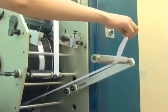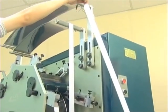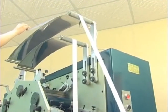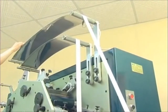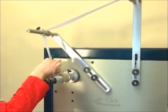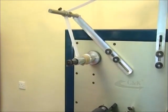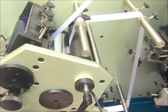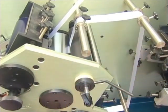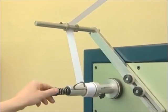When the ribbon is transferred out of the central drum, pull the ribbon to the top heat plate. Place a ribbon core on the rewinding section, then stick the ribbon onto the ribbon core and tighten it. Insert a board to fix the ribbon on the core ribbon. Tighten the nip roller to secure the ribbon. Then adjust the springs and screws on the rewinding section until the ribbon's tension is suitable.